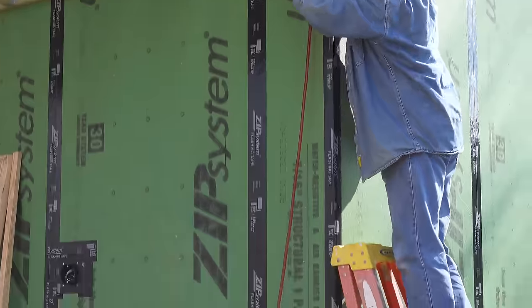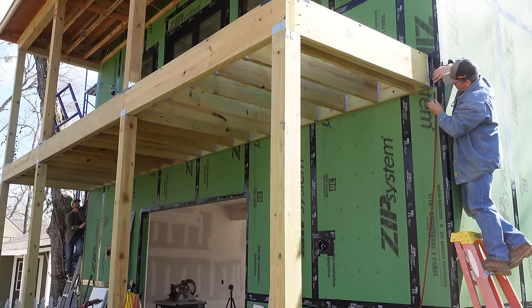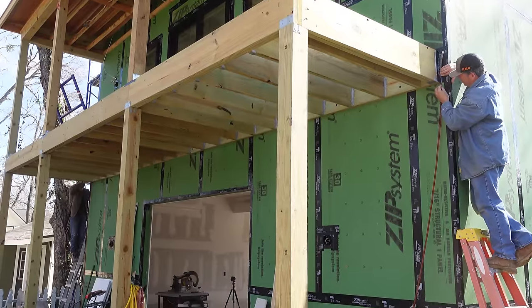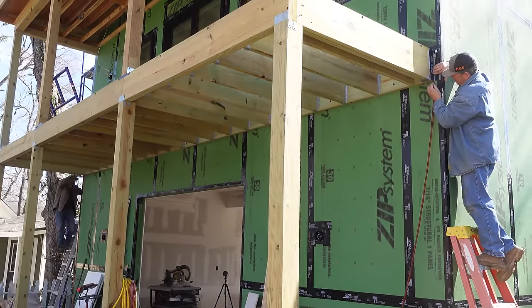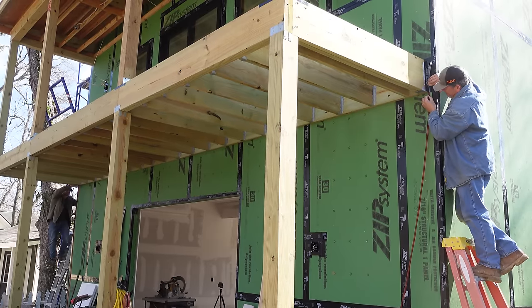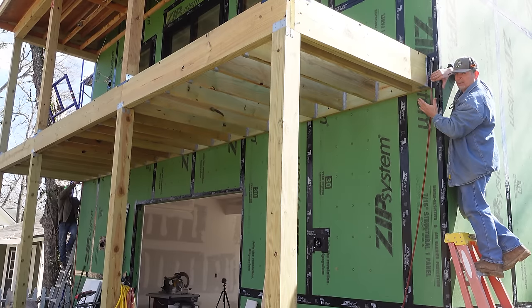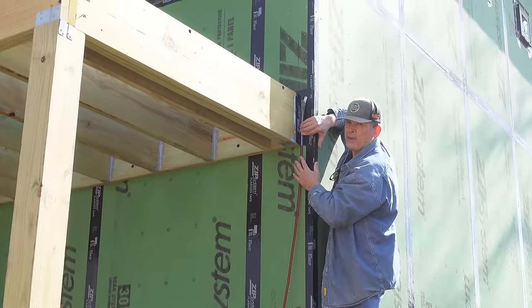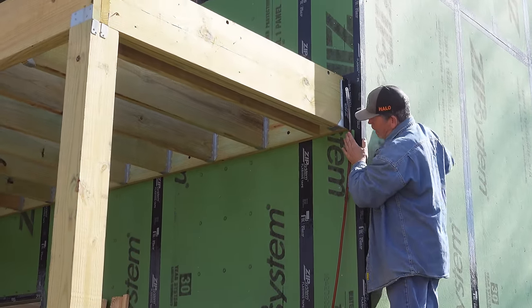Oh, I dropped the cork. Cork down. All right, bud, you stay still. I'm gonna raise it up. All right. Are you good? The water level stopped? That's it on your side? I'm about a 1/16 up. The ledge is a 1/16 high? Yes, sir. Oh, cool. So that's the error in our laser because we know the water is perfect, right? But I'll take a 1/16 over 28 feet every day. Yeah, all right, bud, let's go to our line, mark it, and we're ready to pop some lines.